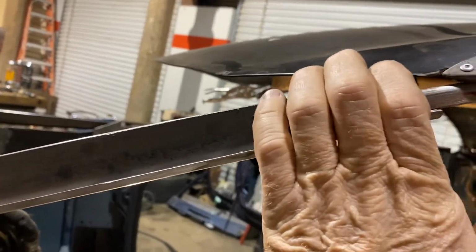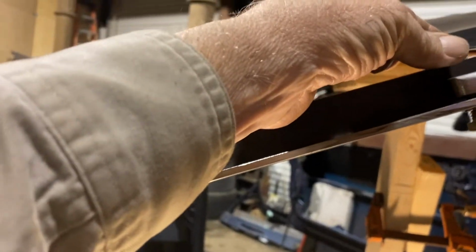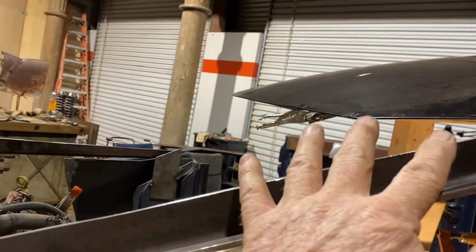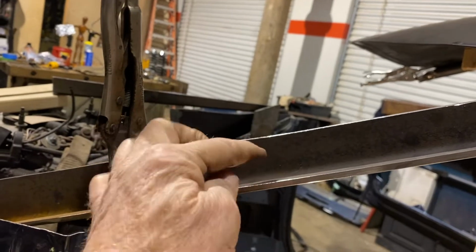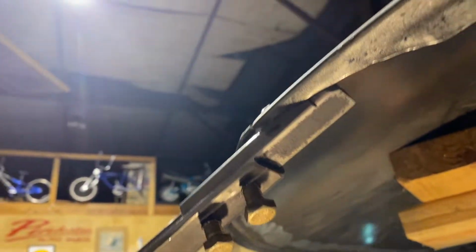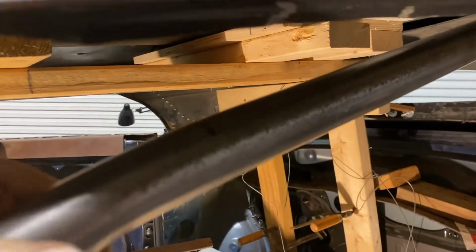This will have the little cover we talked about on it, and the angle will lip over the Lexan. We're gonna have a little plate on here, a little flat that will come and twist a little bit. We can tack that on where we want, and the cover will have some nuts made into it, and we'll screw those in with countersunk Allen heads. These will be countersunk Allen heads as well. And this will weld onto that bracket right there.